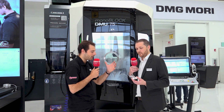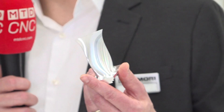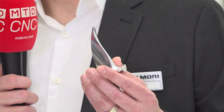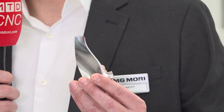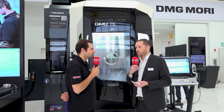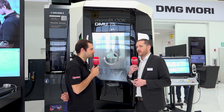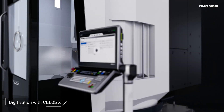We're going to be talking about this demo in a little bit. This demo features a small aerospace blade, created in aluminum just for the show. If you look very closely at it, you'll see that it's imperfect — and intentionally so. We're showcasing a software from our DMQP partner Gemineers. They have a digital twin software for your part, running on our new CELOS X control, which is a Siemens 840D, doing predictive analysis.